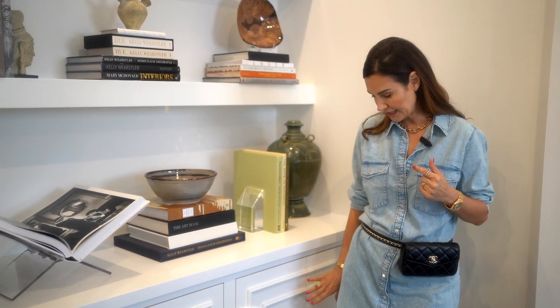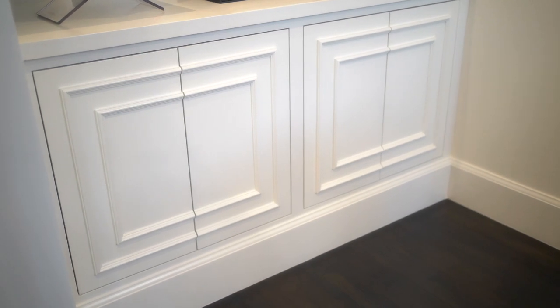What we did, which was very purposeful, is that we had a flat base and applied the same exact baseboard that runs throughout the family room onto this piece so that it would be flush with the wall and look like it had been here for many years. The height of my baseboards are seven and a quarter inches tall throughout my house, so we built the cabinet with an eight inch base — just flat — and then ran the baseboard on top of it.